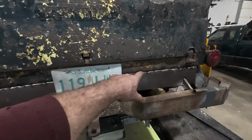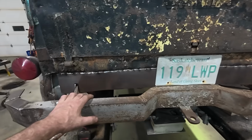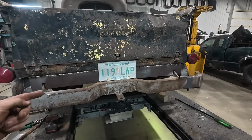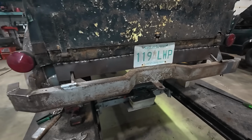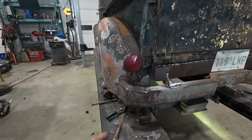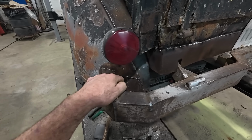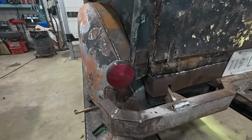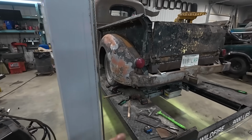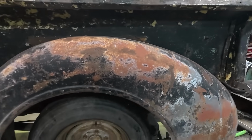I decided to just blitz it. It's welded up solid. Not perfect, but I couldn't warp anything more than I did, and to give the rest of it a little bit of a wave was pretty okay. Kind of did the same down here. I wasn't very glorious when I was welding this. I pretty much just blitzed it. But our patches are in. I just knocked the high stuff off so it doesn't catch your clothes. Other than that, I'm pretty happy the way that stuff all is.